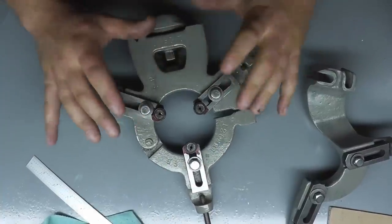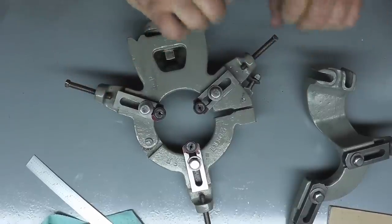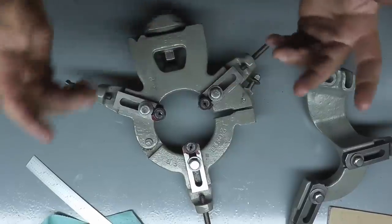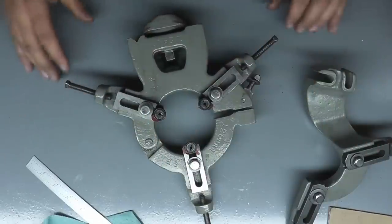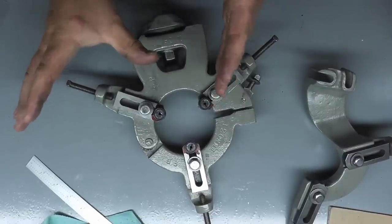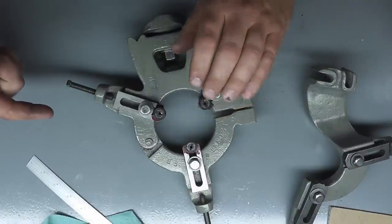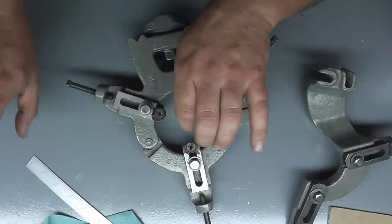Now, like I said, this is usually for working long and larger diameters, almost anything you can't fit through the spindle hole that you need to machine the end of, or anything that needs to stick out where you can't have a center hole or your center's in the way. Think of this as a movable center that you can put anywhere on your part for support. You can also use it if you're working down the end of the line. Say you have a part that's this big or longer and you want to do some machining down here. You have the center in here, but you're worried about the center deflecting a little and you don't want to use the follower rest. You can clamp this in the center, and that makes this section more rigid.